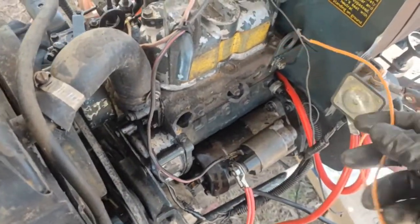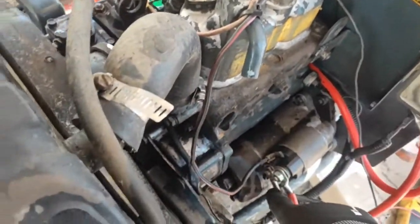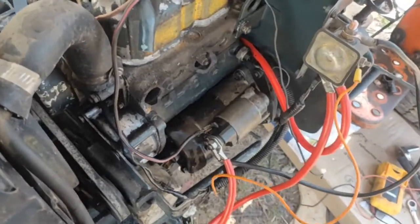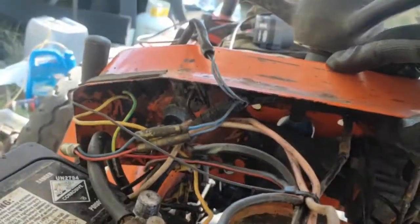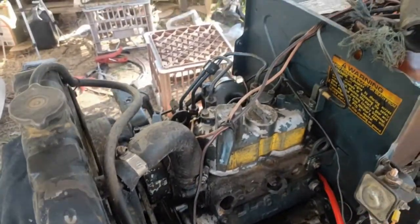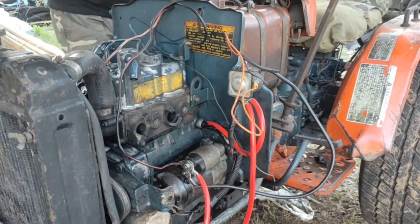So I've got to trigger the relay separate, this relay separate. I tried to put a wire between here and here to see if it would trigger after it's fed the power from the second relay or second solenoid, but it didn't work very well. Anyway, major electrical issues. Just took this out a little bit. If you don't understand what's going on, join the club. Anyway, what I'm going to try and do right now is put a separate switch for this relay. So, okay, let's see if we can get this thing started.